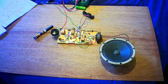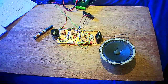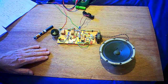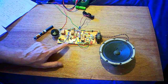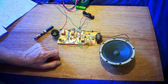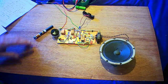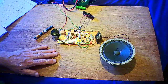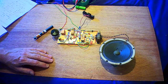I've actually managed to tick off one of my wanted-to-do items with building my own superhet receiver. The oddball thing with it is I'm using the Russian rod pentodes, 1J18Bs, so there's three of them in here. It's not a powerful receiver, sorry, not a sensitive receiver I should say. It's basic. It's got to be basic if I'm building it.